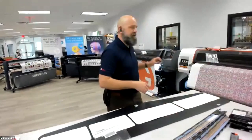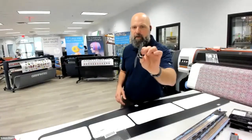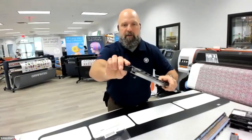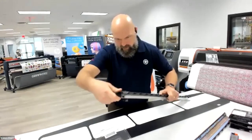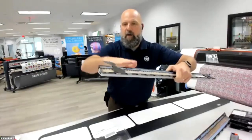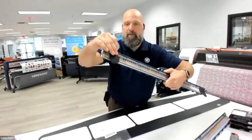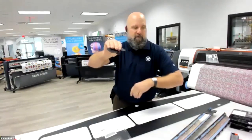Inside the machine, it has edge guards. The edge guard slides onto your platen over the edge and holds your material down. This is a double-wing edge guard — used specifically for traffic material that has a thick memory and wants to ride up. The edge guards keep that material nice and flat through the print zone, reducing the chances of a head strike.